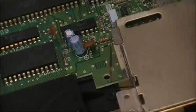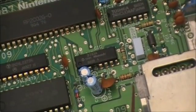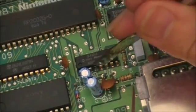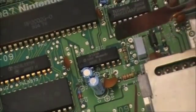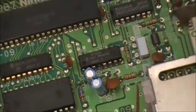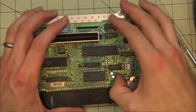Here we go. Well, that should be more than adequate. It's a little bit hard to tell, but it's been cut sheer from here. There's almost no metal sticking out of the side there, and I've got quite a nice gap now just from nibbling at that pin a little bit. I could try to desolder it and pull it out, but I think that will be more than sufficient. Now that that pin is cut, the lockout chip should be disabled, and it should work a lot better.